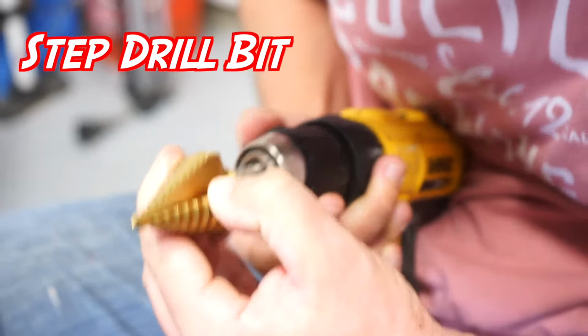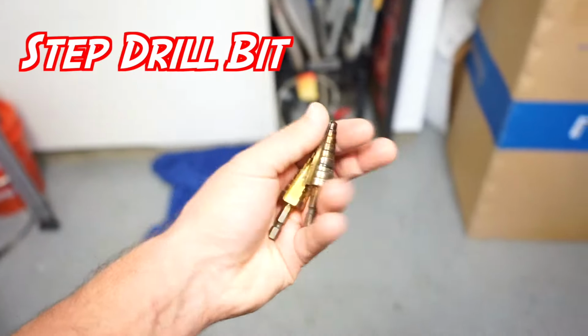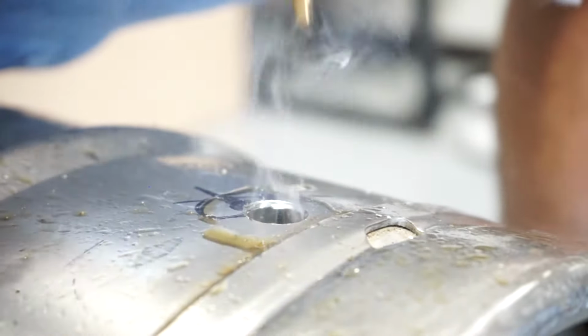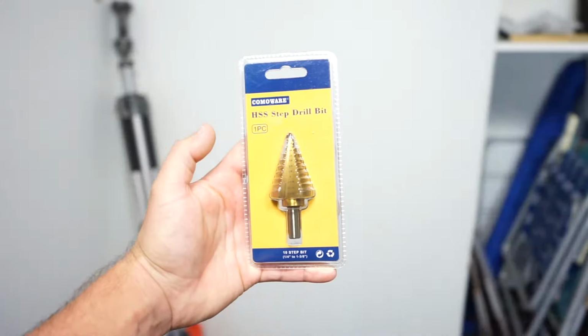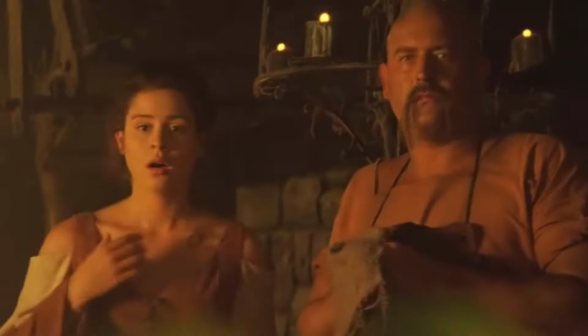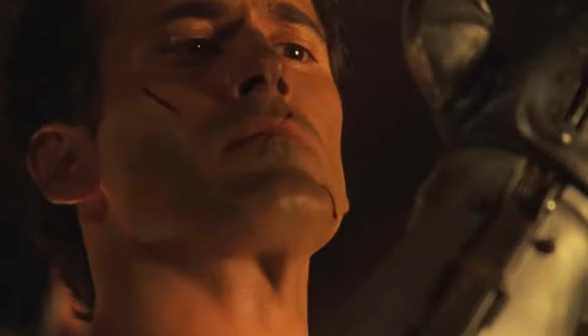Step drill bit. Do not buy brand name for these. They all get dull extremely fast. Snag them at Harbor Freight for around $5. We will post an affordable one in the description as well. Buying brand name will be 4 or 5 times the price. If you got one, just make sure that the drill bit goes up to at least an inch. See, the name of the game is to drill a big enough hole so that this can fit.